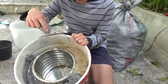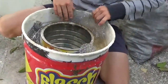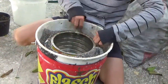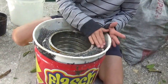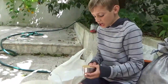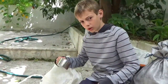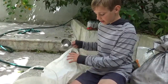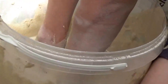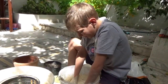Now that we only have the bucket half filled and it's still tilting out, we can use our steel mesh to cover it and hold the top together — we kind of forgot to put it in on the first layer. Edge it in here and make it a little poofy so the plaster-sand-water mix can fill in around it, making it stiffer and stronger. After the steel mesh is in, make more plaster to fill it up — put in six cups of plaster and sand, then six or six-and-a-half cups of water.